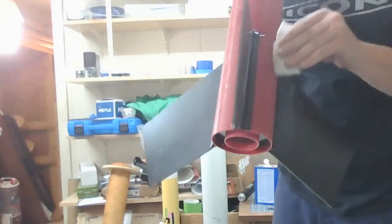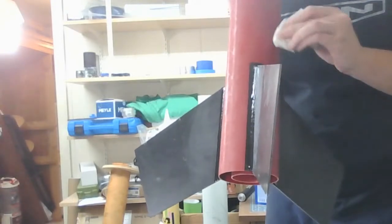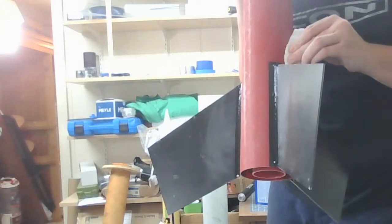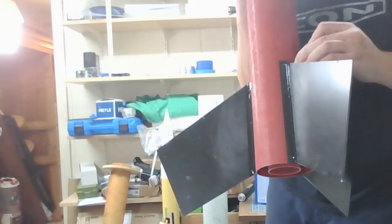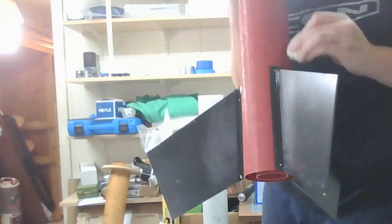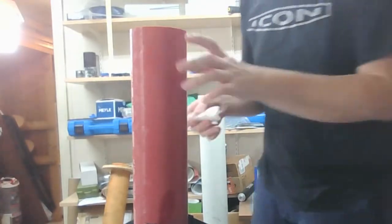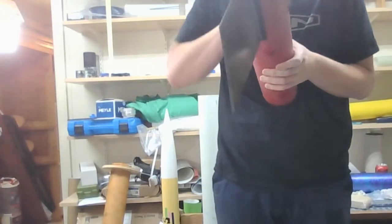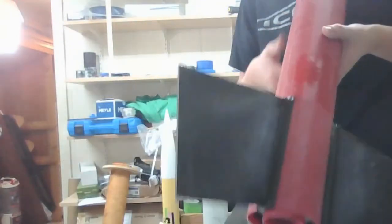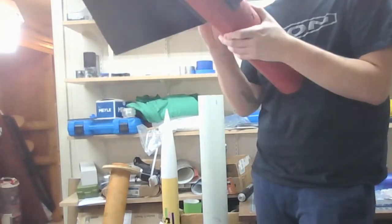See, here's a perfect example I can give you now that I messed that fillet up. Take the denatured alcohol very carefully, follow the line of that fillet, just pull it up and out of there. Flip this to the other side. There you go. Boom. Never happened. That looks pretty good. Black Whiff system is kind of cool.